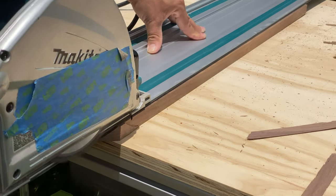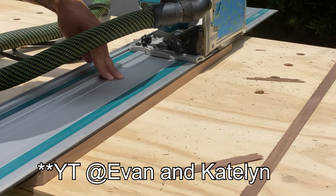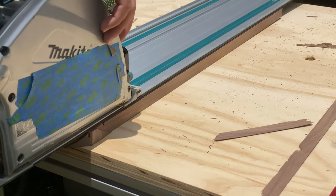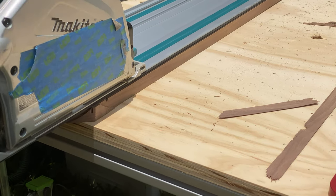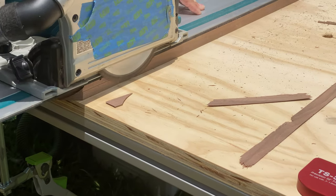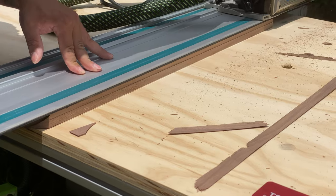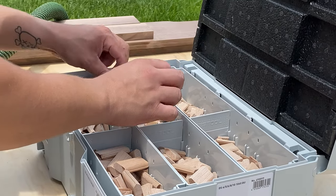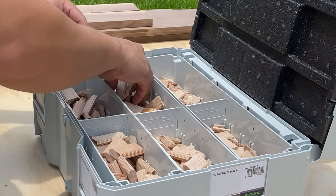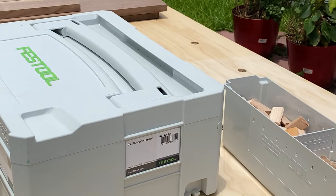These small pieces are for doing a shelving unit. We're following more or less — not exactly — a video by Caitlyn and Evan; I'll put the link in the description. They made a shelf for coats; we're using it as inspiration but making ours for dog leashes, with shelves to hold the poop bags. The walnut pieces we have are a little thinner than we need, so we're going to use dominoes to stack them together and get the thickness we need.